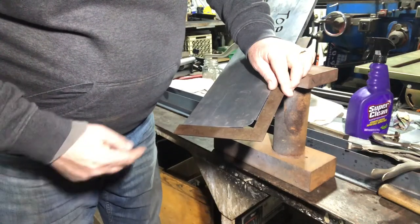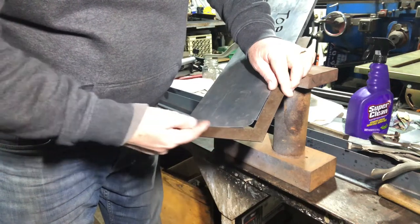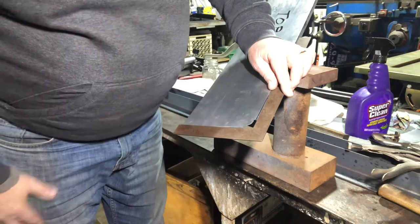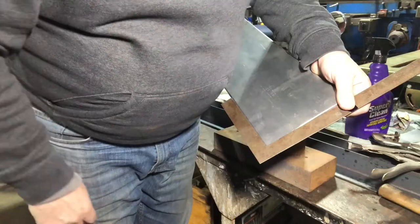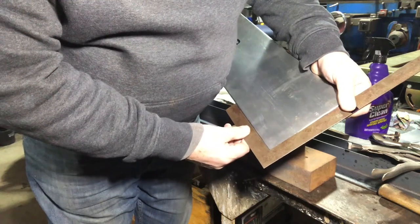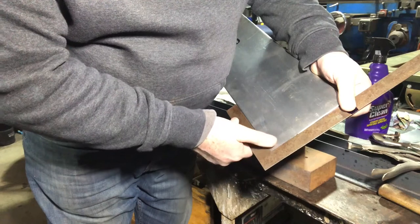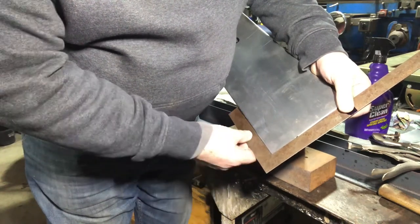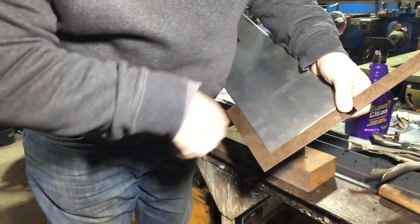The blade of the solid square is right along this brake line, and same with this blade — it's right along this brake line, and you can see it's a beautiful 90-degree corner. From the other side, you can see this side is also a perfect 90 degrees along this flange — and the same flange checked from the other side. It's hard to do this with one hand.